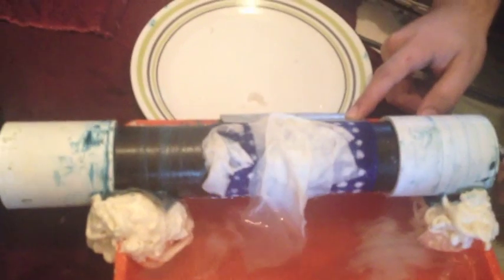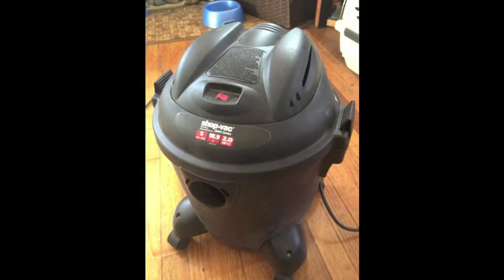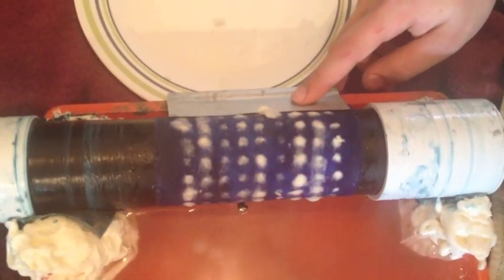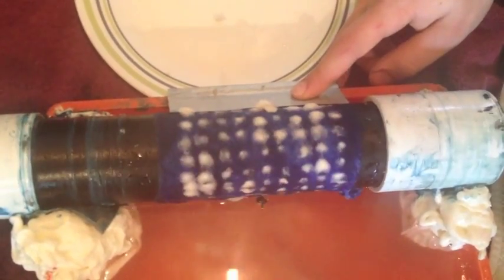For experimentation on our design, a thicker cake is required — approximately 5 to 7 millimeters for toilet paper. We cannot make a thick enough layer because the vacuum's capacity is about 4 gallons, so only 4 gallons of slurry can be filtered during a single run. Our project still does work, but the cake is difficult to collect because of how thin it is.